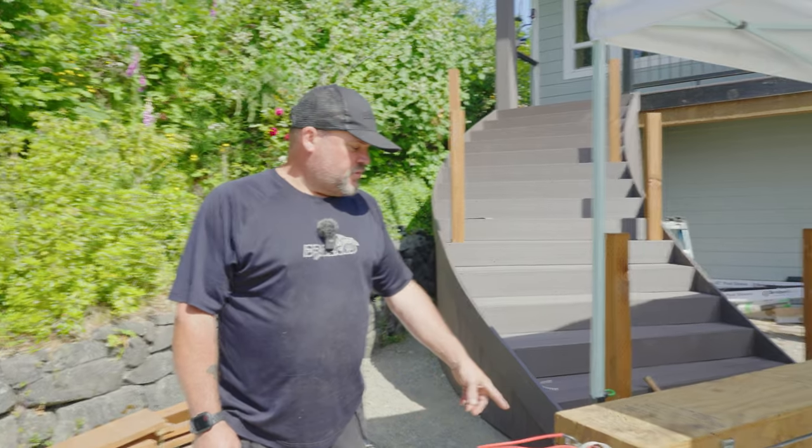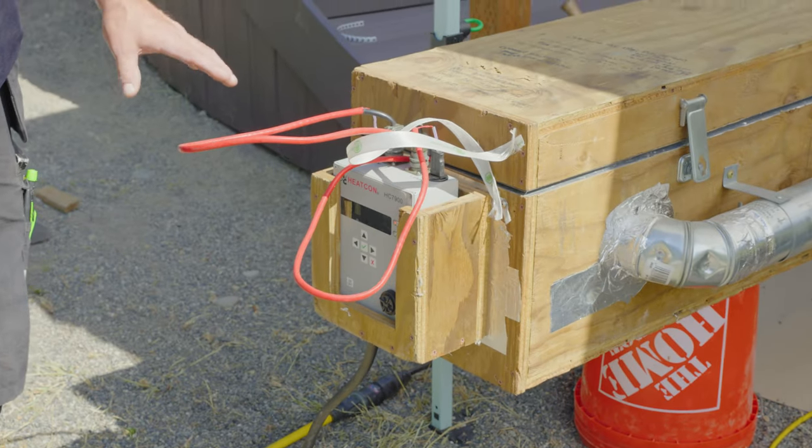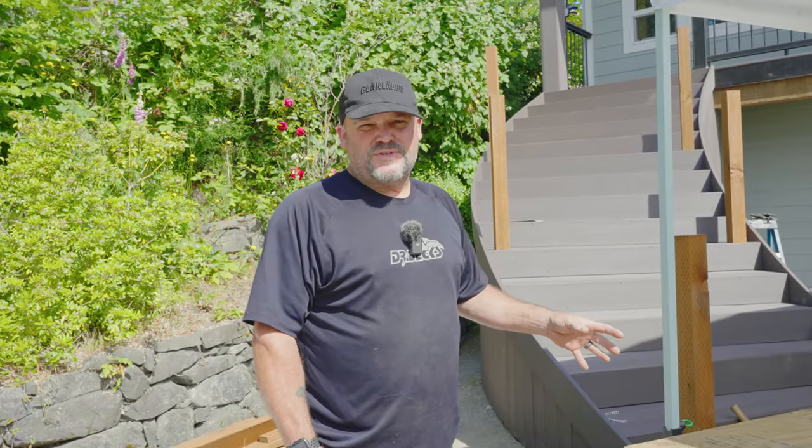So over here we have the control unit. It has one HeatCon box. There's a top blanket and a bottom blanket that are running heat inside of this. I'm trying to keep this box around 240 degrees or so. It just depends. It's kind of variable. Every time I lift the lid to check parts, I lose all the heat. I gotta drop it back down, keep everything going.